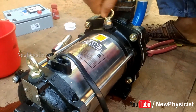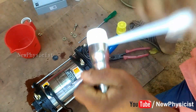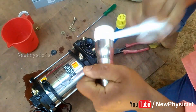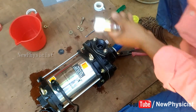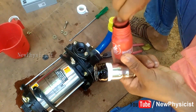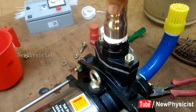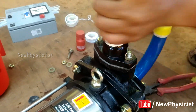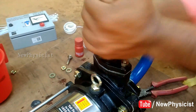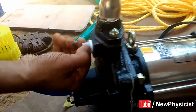Next is connecting the hose collar to the delivery side. Apply teflon and shellac and perfectly tie it to the pump. If necessary, use a pipe wrench to tighten the hose collar. Any leak in this joint will negatively affect the performance and efficiency of the pump. Also, don't forget to seal the drain plug by applying thread seal.